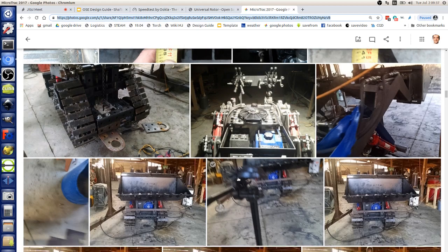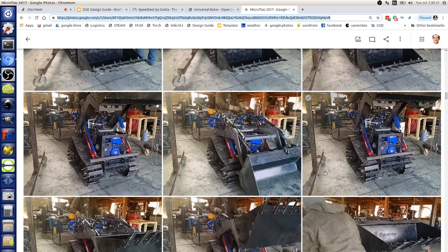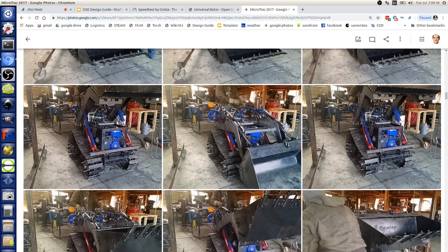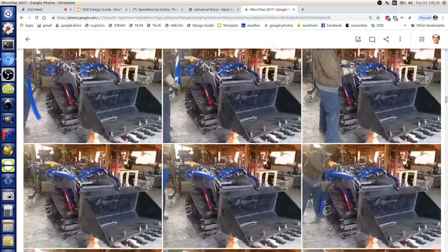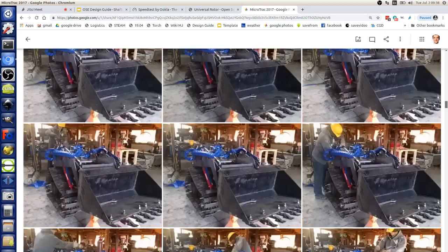You can work with shafts up to three inches for tractors — very heavy. That means you can make a bulldozer, a twenty-thousand-pound bulldozer. This is about as serious as it gets: a 3-inch shaft, with a DIY way to mount it upon bearings with zero machining. That's an important concept. John Deere would have shafts machined finely with steps that physically lock the shaft from moving in and out — you can do the same thing in a different, more accessible way.